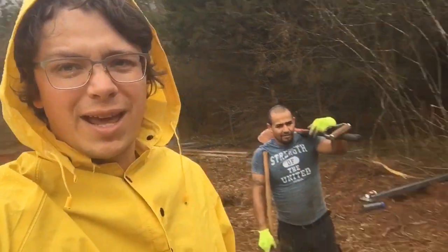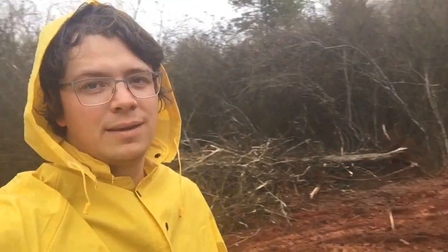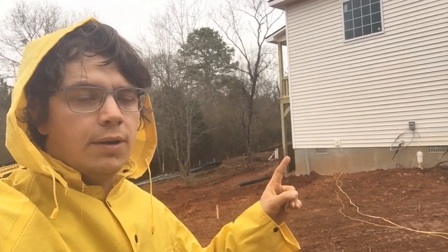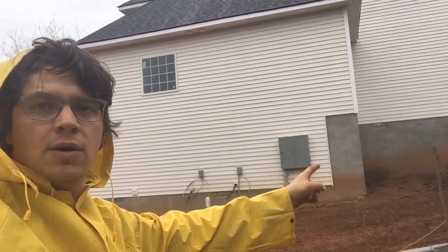It's been raining this February 2020 in Georgia — like 20 out of 30 days of the month. Solar's in the ground. Posts are in the ground, thanks to the Georgia buggy. The big boss himself is digging away. We've got the conduit in the ground and the solar in the ground. From a solar standpoint, it doesn't get much better than this. You've got a cleared-out field, and the trench just goes right uphill to the septic tank area at the back of the house where the utilities are. We're going to bring our pipe right there, go into the crawl space and go around, and put our disconnect up. That's where we're going to tie this thing in.